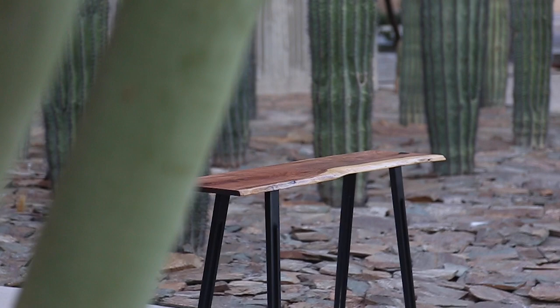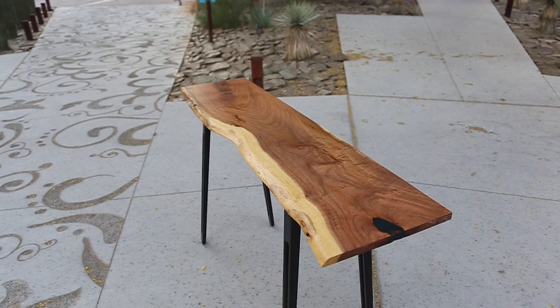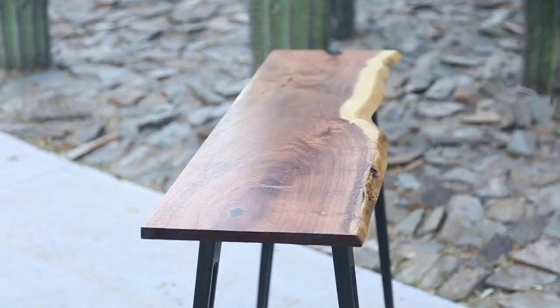Let it sit for maybe a week, and then give it another good polishing with an ultra-fine-grit synthetic finishing pad. You can follow that up with some paste wax too if you want — it really makes your project shine and look great. So there you go, guys. Thanks for watching. My name is Mark, I'm from Woodworker Source — we're your friendly hardwood lumber supplier, lumber straight to your door. If you liked the video and got something out of it, hit subscribe, give it a thumbs up, and come give us a visit. Thanks for watching, really do appreciate it.